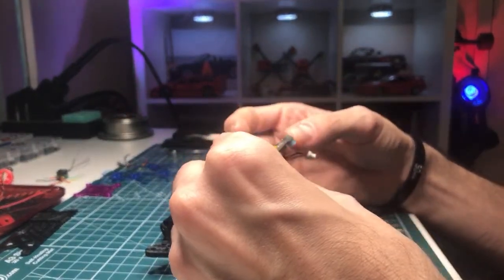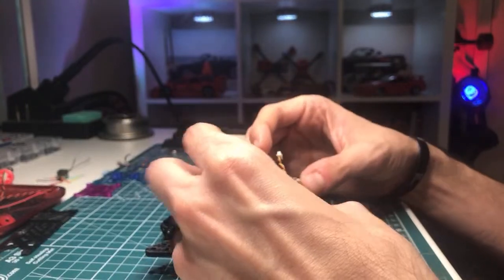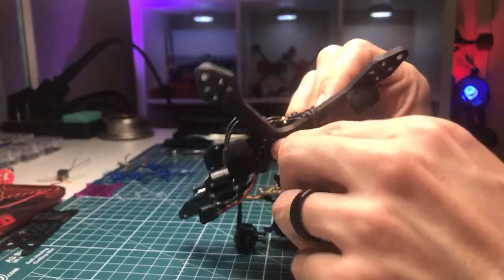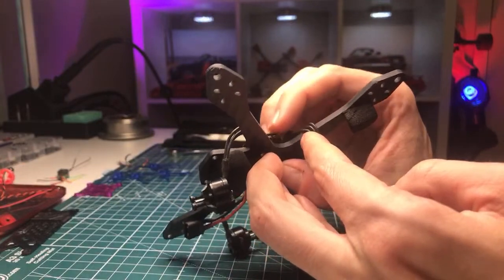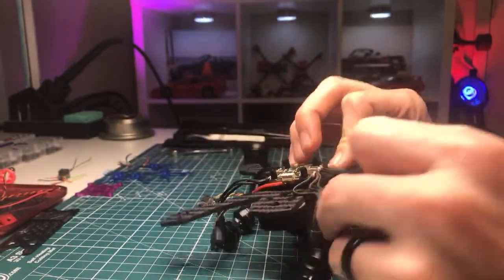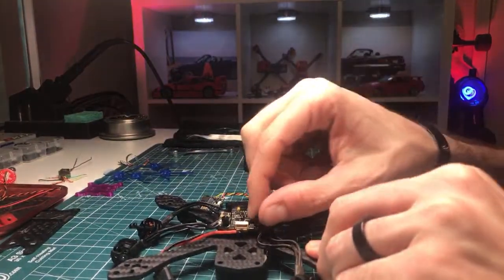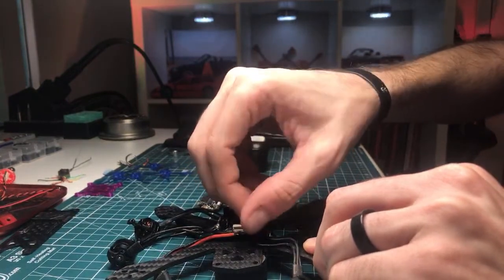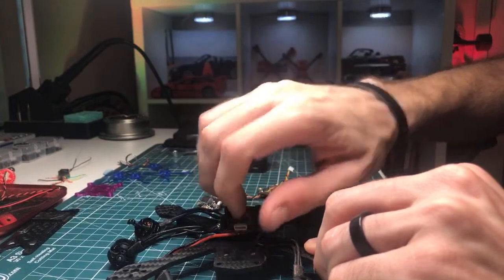Maybe I'll switch the gummies. I have these same gummies that are not taller on the bottom. I don't think I really want these to be taller on the bottom. So the only problem with those rubber M2 Vibe standoffs is that you're forced to have a female side and a male side. And what that forces you to do if you run the screw upwards is you got to run some kind of a thick spacer here to catch the threads and then to thread in from the top on.